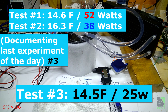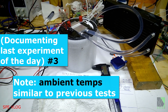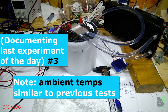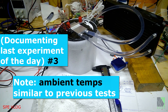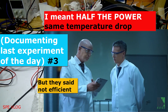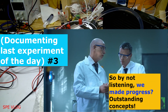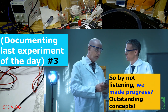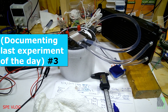This time it's only taking 25 watts to reach that temperature. The last time I did a test like this and reached 14 degrees Fahrenheit in this chamber, it took 52 to 55 watts. That is a huge difference — we're talking about almost twice as much temperature drop for half the power. That's ridiculous. I'm careful with my words and I don't want to create false hopes, but it does appear my theories have paid off and are being validated. I ignored everything on YouTube and followed my own path.